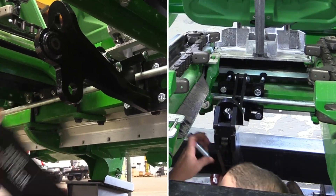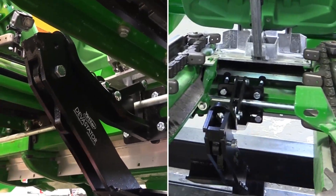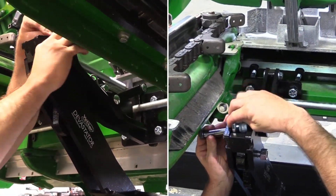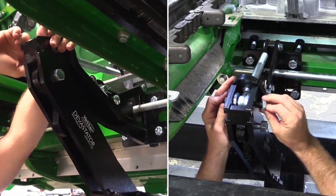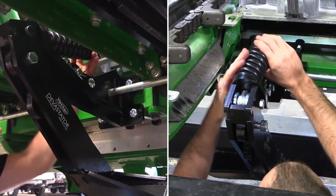After the arm is attached, put the eyelet bolt through the main mount bracket. It is held in place by a shoulder bolt with a washer on each side. This bolt is captured by a half inch locking jam nut. Do not over tighten this nut, just snug it — the shoulder bolt should still spin without much force from an allen wrench.